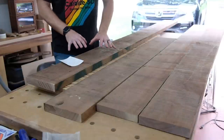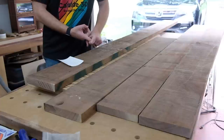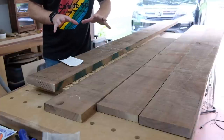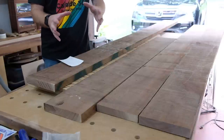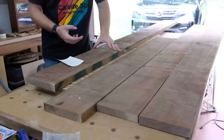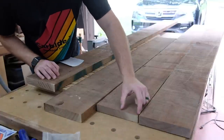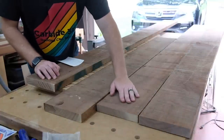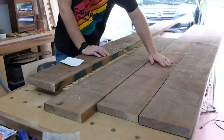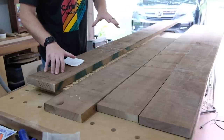Let's talk about what my priorities are right now when picking out what pieces go where on this rough lumber. My number one priority is the outer casework — that is the largest material in both length, width, and thickness. So I'm going to prioritize getting those pieces and then I'll work my way in towards the smaller, thinner pieces. My second priority is the doors. That's going to have the most straight grain for the rails and stiles. This piece right here has the most sapwood, which is not going to be usable for the case. So I'm going to keep this straight grain here for the doors and mentally keep this aside and not use it for the casework or dividers.